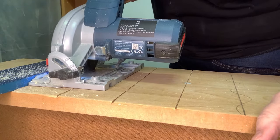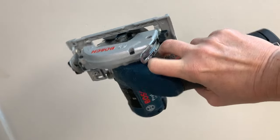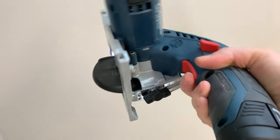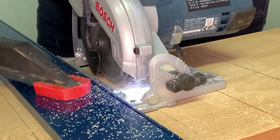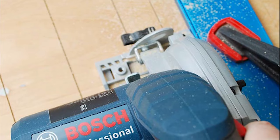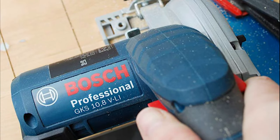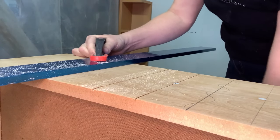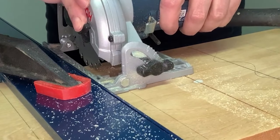And let's talk about cutting — I am obsessed with my new tool. This is a cordless Bosch mini circular saw with an 85-millimeter blade, which I believe is just a touch over three inches. It's super light, easy to handle, and it cuts through everything like butter. I am just tickled pink with this tool. To finish the design on my drawers, I set the depth of the blade for a couple of millimeters in and then used a straight edge clamped to the front of the drawer as a straight guide. This technique will give you perfectly straight lines every time.